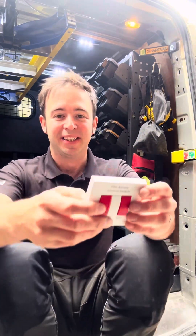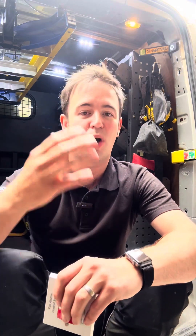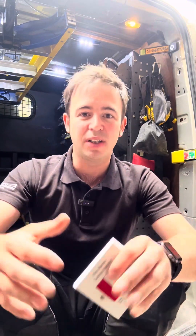Very easy to wire up. I tend to wire smoke detectors on their own dedicated circuit — always have done. I know there's a debate, especially with rental or council properties where they'll wire off a local lighting circuit so they can't be turned off. However, for most of my jobs in the private single-dwelling sector, I always wire them in three-core from the consumer unit.